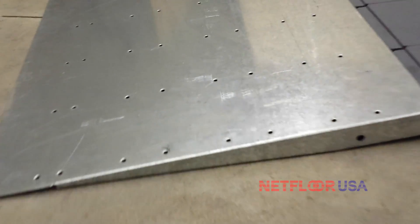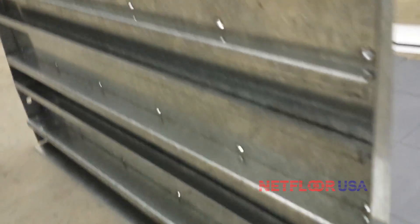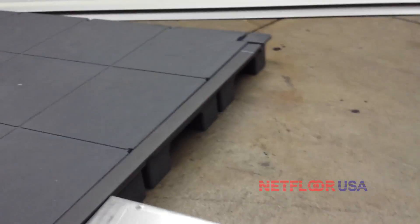You would have a full piece of carpet starting here and going over this way. For the two foot wide ramp section, if you flip it up it does have some contact points on the bottom where you can put adhesive. You can use any type of liquid nails or specialty access floor pedestal adhesive, and that will adhere it to the subfloor very well.